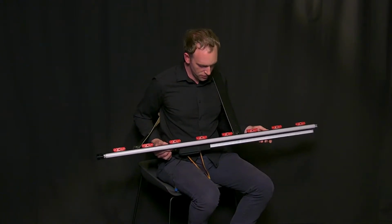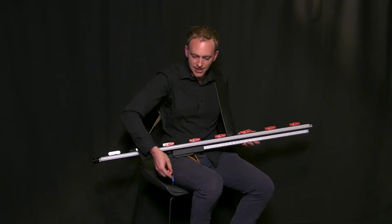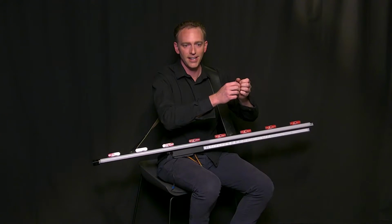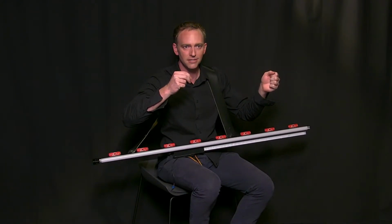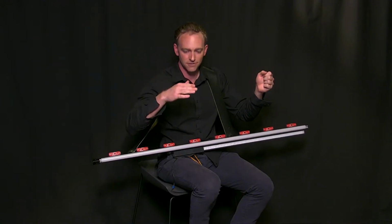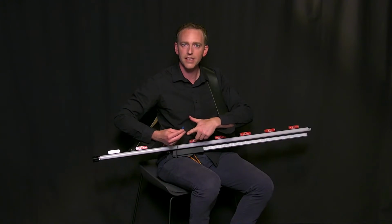There are a couple new sensors that I wanted to show you. The first is this thing that I call the ePick. And the ePick is just an off-the-shelf bend sensor. And you can imagine for a moment that you have a bow and arrow. And two things that I'm tracking is if you pull that bowstring back, that gives you the amount of energy or pressure that you're putting into that system. And then when you release it, that indicates an event for a pluck. And I'm measuring that in both directions on this bend sensor.